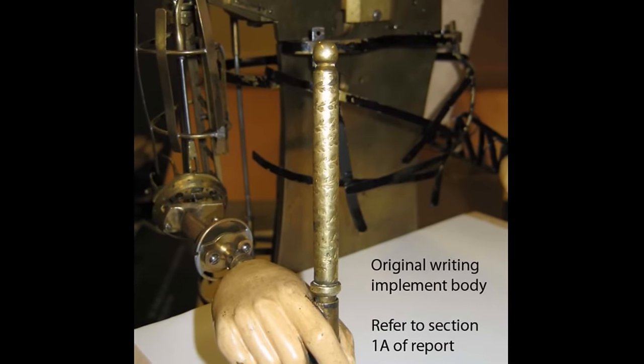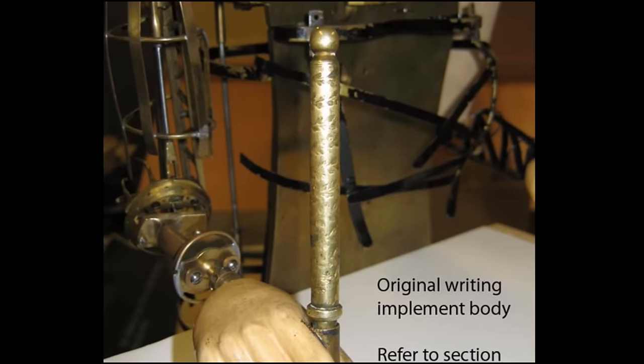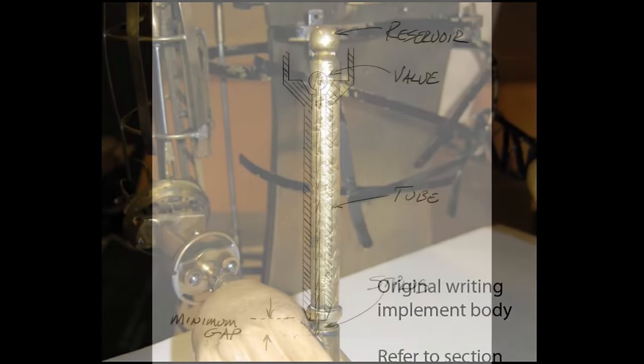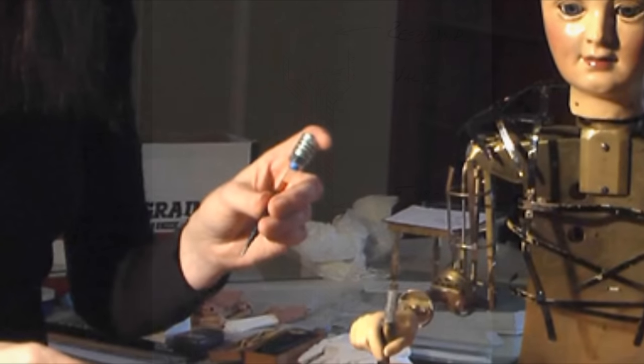This is the only thing that exists of the original pen — it's the actual ink reservoir for the pen, but the pen tip and the head is missing. And this is my drawing of the floating stylus concept that was most likely used, where a very lightweight stylus is inside of a tube with a weighted valve on the top, which allowed variations in the z-axis cams to be translated into variations in ink flow. As the pen is lifted and lowered slightly to the paper, the ink would vary in its flow down to the tip.